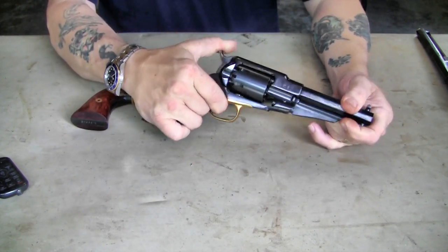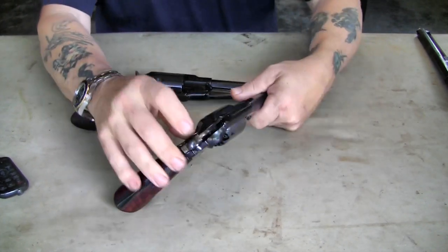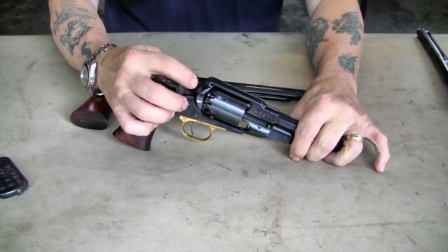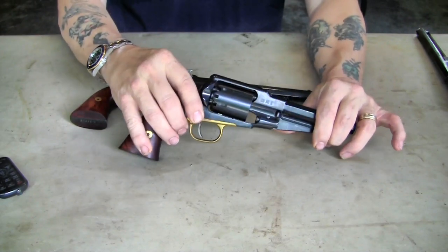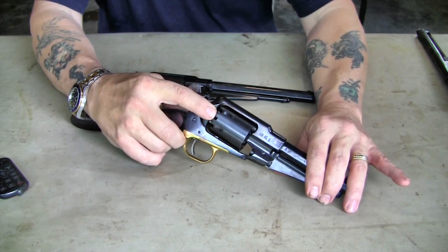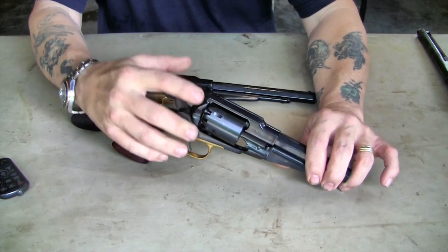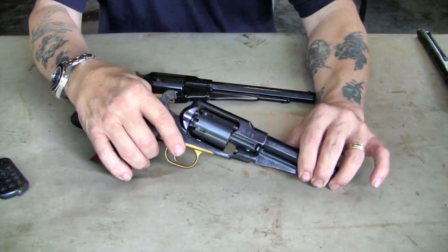Okay? So, what happens when you've got this design? Also, you see where there's just a little slot in the frame. So even if a nipple gets stuck on the hammer, it's usually peeled off or held inside the frame. And also, I believe the way Remington designed this, the difficulty of capping it, these shields or something, or the shape of the cylinder around the nipple, I think is also in play for not having the nipple expand out and create the jams.